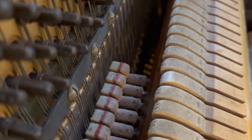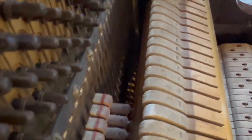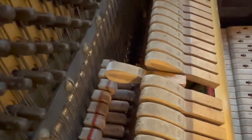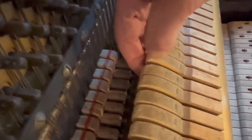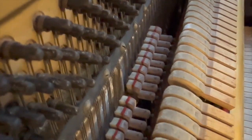It's a bit clearer. If you change these hammers it would totally alter the tone. I suspect you could probably reface them — there has been quite a lot done already. Replacing them would improve the tone but you'd have to reweigh the whole action. That is an option, and I think it would improve the piano considerably if they were replaced, but let's perhaps reface them first and see what kind of tone you get. That's the kind of decision you have to make. The felt is a bit on the hard side.